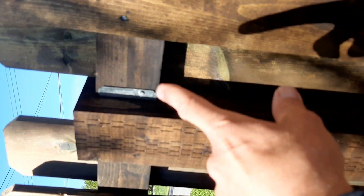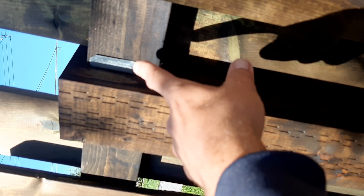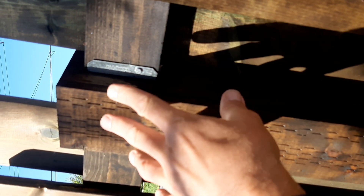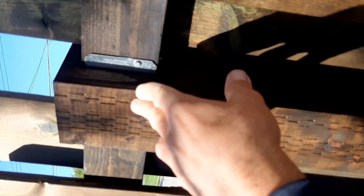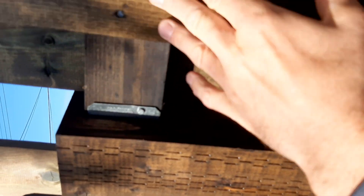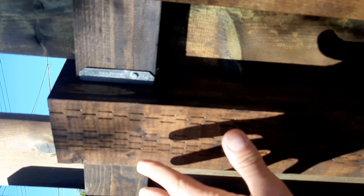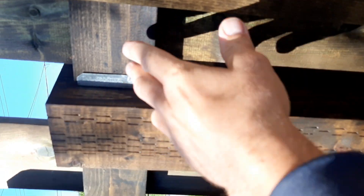I put my rails vertically — it is stronger — but the only downside to using your rails vertically with a four-and-an-eighth post is that you can't get your pickets to run through, obviously, because of the profile difference.